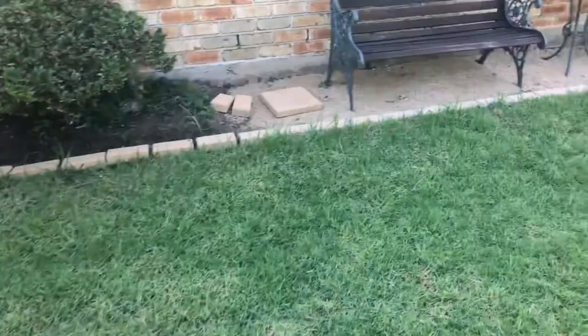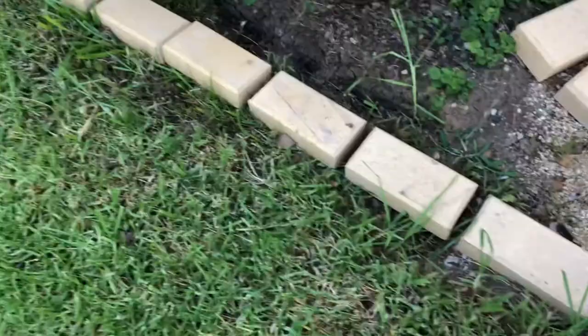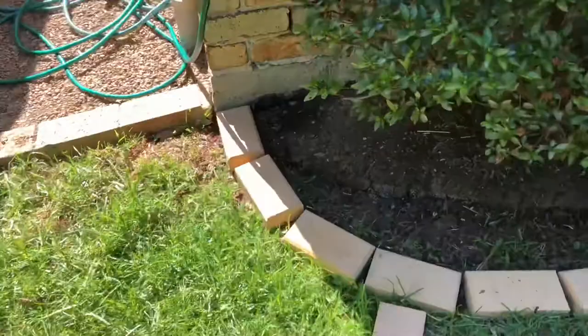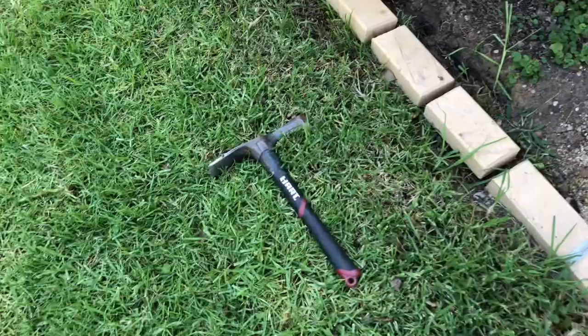There's a new bit I've just put some pavers out on the grass there. The first step is just to map out where you want to do the edging — just put them on top of the grass. Make sure your spacing is right: you want a bit of mortar between the pavers, not too much and not too little. Get a nice look, and sometimes a nice curve looks good.